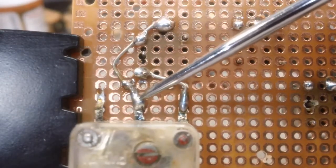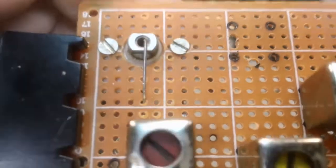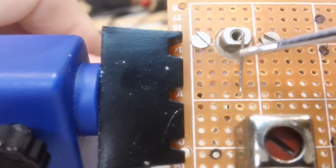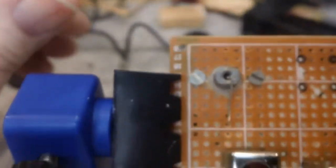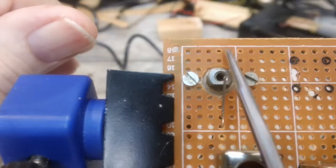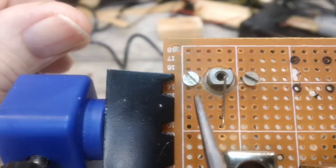And if you look here, there's a little nub sticking out here. Well, that nub goes up the top here, and I'm going to flip her over, and you can see this wire here sticking up. That's going to be the thing that goes around the capacitor like this, and also connects to the ground on this side. There'll be a ground bus over here. So that goes all the way around. I'm just going to use a wire for it, because that's the easiest way to do it.